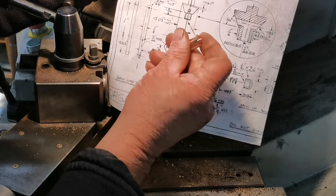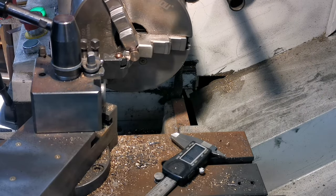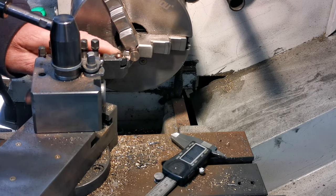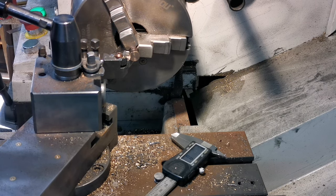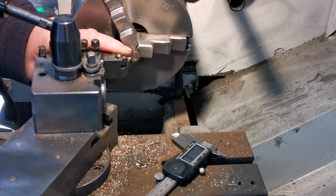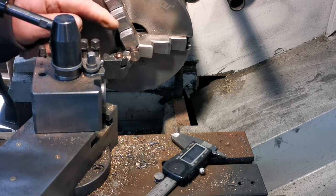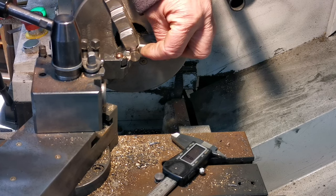straight on there. So let's get this in the lathe, in a chuck. So you can see I've marked on there, that's 1/4 inch. So I've got to turn this first part down for the size of the thread, which is 1BA. Once I've got that down, that piece of thread's only got to be 1/8 inch long. So I should then machine the end down, and then we've got to do the angled turning.